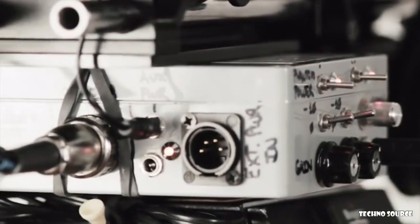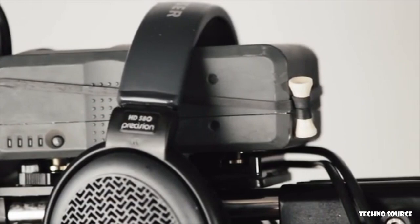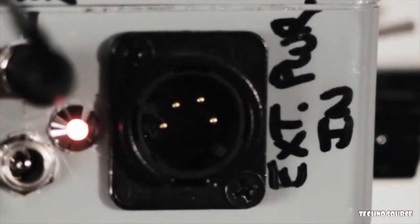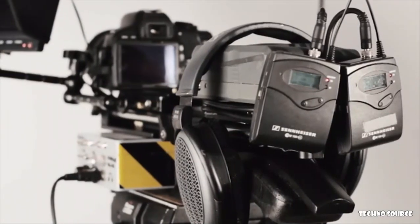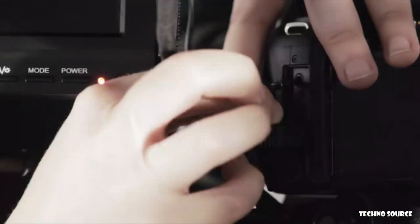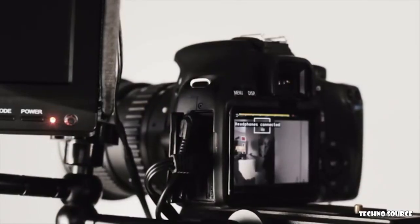First, it solved the DSLR power dilemma. It works with 12 or 14.4 volt broadcast batteries, power sources of all the common chemistries. We settled on a high-speed switching circuit that automatically goes through the 4-pin when power is applied. You can change it right in the middle of a shot. A single multi-pin connector provides all the connections to the camera, power and audio. Then we added more things.